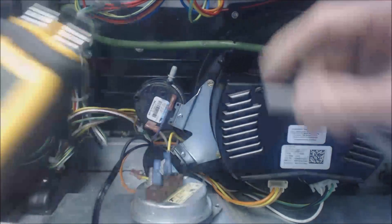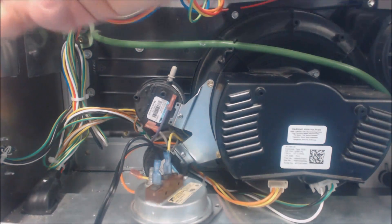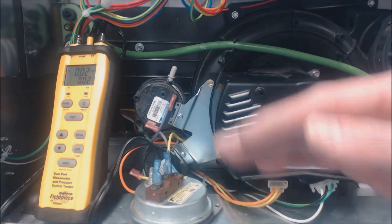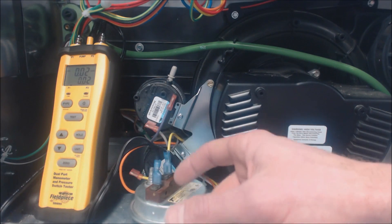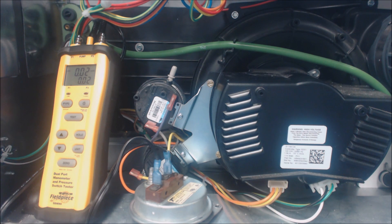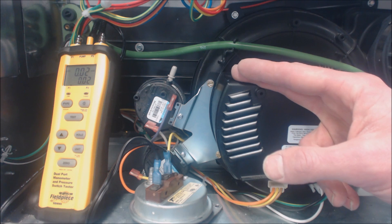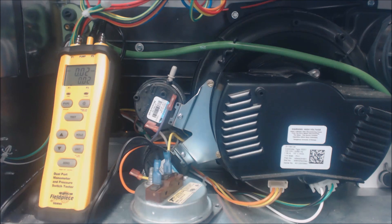There could still be some other type of problem, like a condensate line that's not draining well. Remember, as the furnace runs, the condensate line is filling back up again, and if there's a problem draining, it's going to work intermittently and throw a pressure switch error code. Make sure the condensate line is pitched properly — a quarter inch of pitch per foot going away from the unit — and that it is draining properly and the tubes are not clogged. Also make sure the inducer motor is working sufficiently, the exhaust is being pushed out of the building, and there's no clog in either the intake pipe or exhaust pipe. If you have a cracked heat exchanger, that can be an issue as well. Hope you enjoyed it — we'll see you next time at AC Service Tech channel.